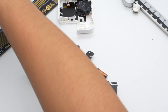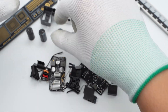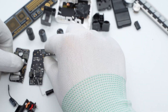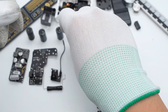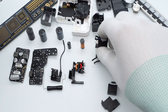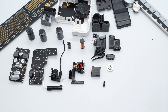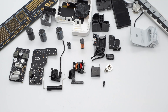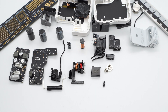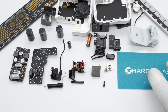That's all the components of this charger. It continues the exterior design of older Apple chargers, but its interior design and architecture are completely different. The PCB module is divided into two parts: the AC-to-DC part outputs a fixed voltage, and two synchronous step-down circuits output different voltages according to the connected devices. The master control chip is a customized model, the same as in Apple's 96W and 30W. The rest of the components are from famous brands like Infineon, MPS, Lighton, and Nichicon. We'll have more videos about this charger coming soon — stay tuned!